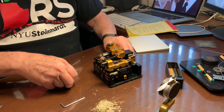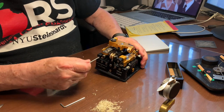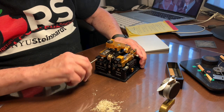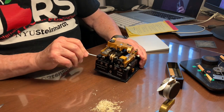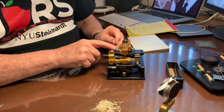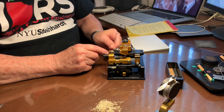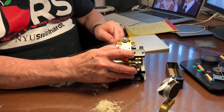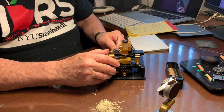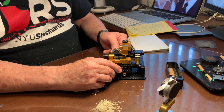That'll usually ensure the back is measured. If it doesn't, you can take a small Allen wrench, loosen the set screw, and then turn this screw. Because you're moving the whole profile, I like to set the small side of the Allen wrench into the screw so I can see where it's at, and I make very small motions at a time.